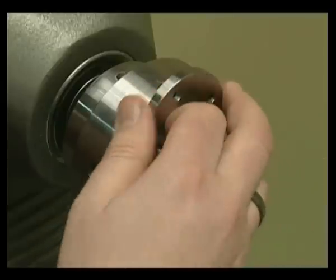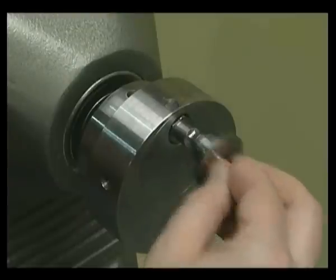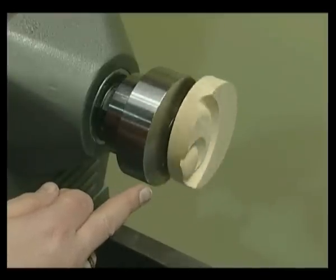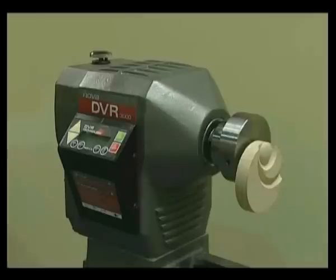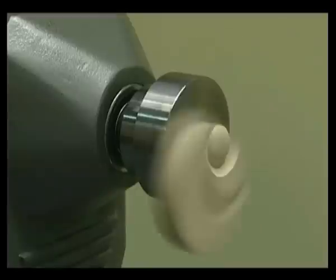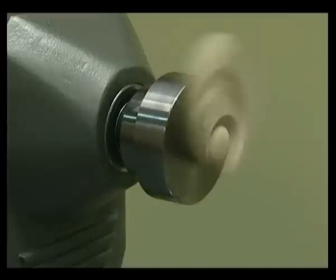The combination of the amount of offset of the eccentric boss and the position of the bihexagonal socket makes this the most versatile eccentric chuck available. The Robert Sorby eccentric chuck weighs around 5.5 pounds or 2.5 kilos, designed this way to counterbalance the weight of the workpiece when it is offset. This gives more stability than any other offset system, where the main components are also offset from centre, adding far more weight and creating a greater imbalance, which would substantially reduce capability and increase risk of damage or injury.